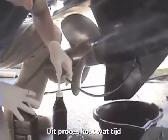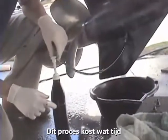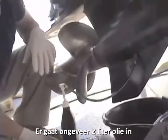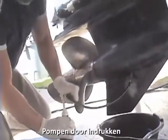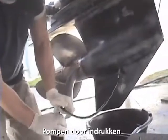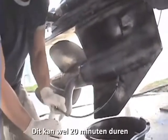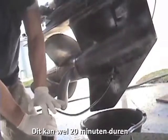This process is going to take a little time — you've got to pump it. There is an oil gauge on the side of it and it is going to take about two and a quarter to two and a half quarts of gear oil. The process is just pumping like this. I'll be back in about twenty minutes when I get the fluid in, because it takes about that long.